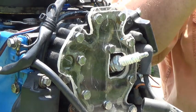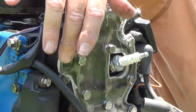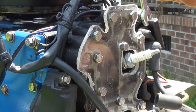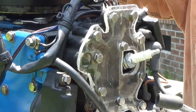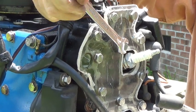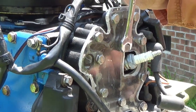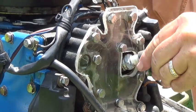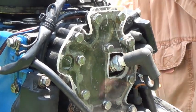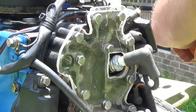I took this cover off because this engine was running cool and I thought the thermostat was either stuck or missing. As I took it apart, I saw that the sensor that tells you the head's hot is also missing. My stepson bought this for his boat and I've fixed it up a bit, but it makes me wonder why the sending unit and the thermostat were both taken out. So first, I've made a clear plastic cover to watch what the water flow does when we run it. We'll start it without the thermostat, then put the thermostat in with the same clear cover and watch how it does.